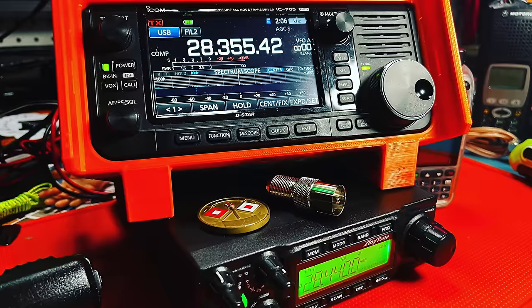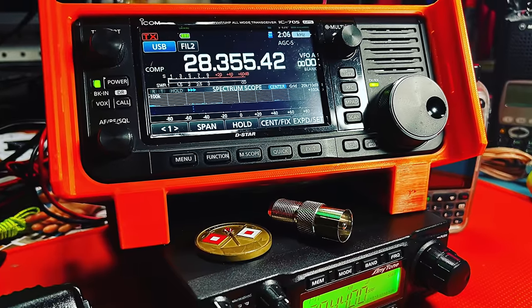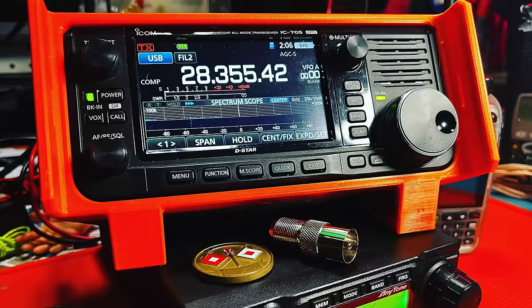With that said, it has a lot of capabilities. With its internal GPS, I'm able to basically always have a repeater or radio solution for repeaters in my area, or well-known documented repeaters that run off of DSTAR but also analog - think traditional FM analog repeaters. And that's exactly what you saw in that video when we were talking with that fellow ham in Heber, Utah with Mike Glover. I use this primarily for emailing over amateur radio or sending data messages with software modes like JS8Call and FT8.